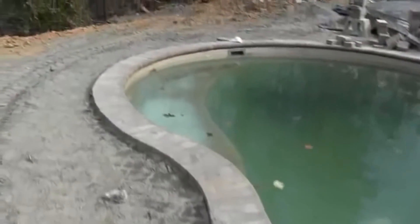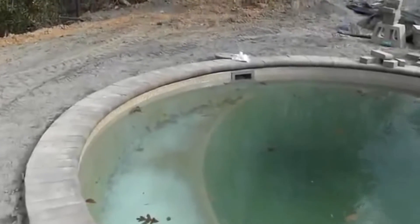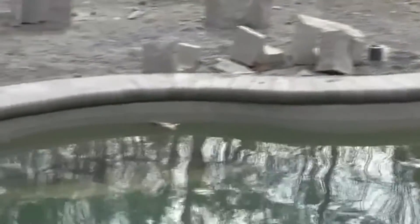So what should have happened? Well, there should have been a concrete pool beam placed around the perimeter of the pool, in this case approximately 250mm wide. The coping should then have been adhered to the top of the fiberglass pool edge and also to the concrete pool beam with the correct type of stone adhesive.